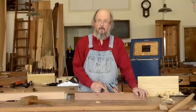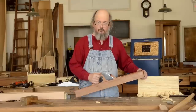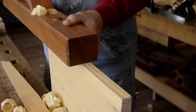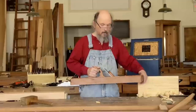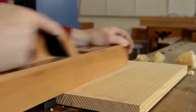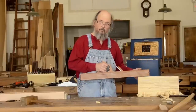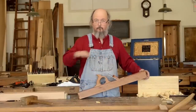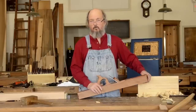In the kit of bench planes that a bench worker might have in their shop, the jointer plane is the longest of these planes. The primary function of the jointer plane is to joint the long narrow edge of boards for gluing up boards edge to edge. Another function is to flatten out large wide panels. The planes in my use are sharpened differently in those two situations — a square-edged iron for joining edges and a slightly cambered iron for joining the large faces of boards.